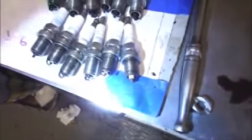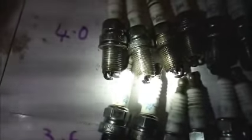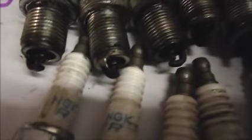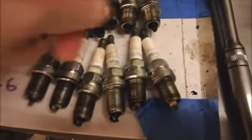Encouragingly, if you look at those plugs, you can see we've got tan, tan, black, bit tan, tan, black but not totally black. Whereas on the back engine, we've got, oh, that's an interesting strobe effect on the lens. That's giving people headaches. Okay, hold on. Alternative lighting technique. So you can see the back ones: oily, scummy, oily, scummy, scummy, filthy. So, all in all, the front engine's looking quite positive, mixture-wise. Back engine's looking black as a black thing.